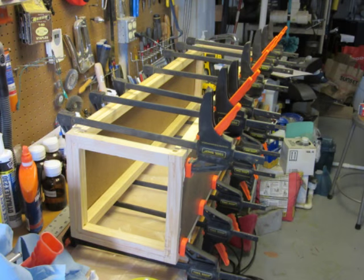I always put in the inlays on opposite sides, two at a time, and then use some cheap bar clamps to thoroughly clamp them along the glue joint. This is necessary because you need to have a very good fit for the Gorilla Glue to set up properly, and also you don't want the masonite bowing away out of the inlay and not laying nice and tight down into the inlay. So the clamps help with this and they keep everything together. Gorilla Glue sets pretty quickly, so you don't need to clamp them for a long time. Usually, 2, 3 hours is plenty.